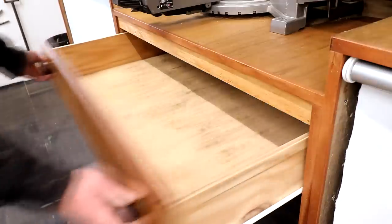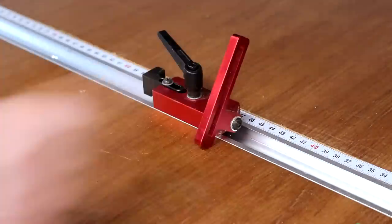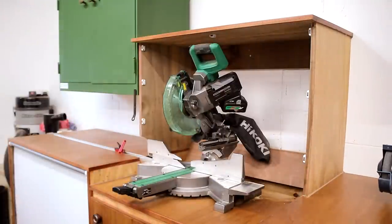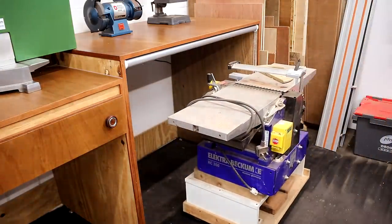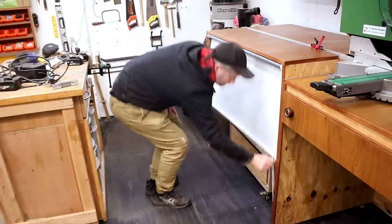In this video I'll be showing how I built my new mitre station. It'll have a few of the usual features and a few unusual ones too, including a passive dust collection drawer, t-track and stop blocks for repeatable cuts, and a hood and shroud to help contain dust. It's also going to accommodate some of my larger machines like my thickness planer and bench belt and disc sander underneath, which is going to be a real space saver, and those are going to have dust shrouds too.